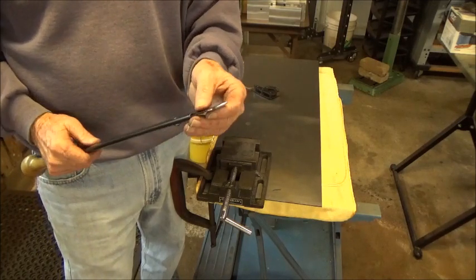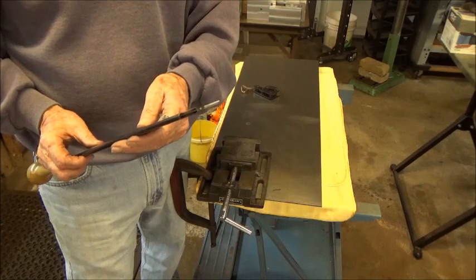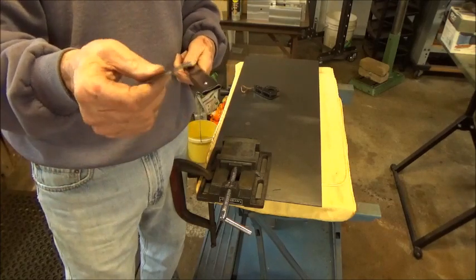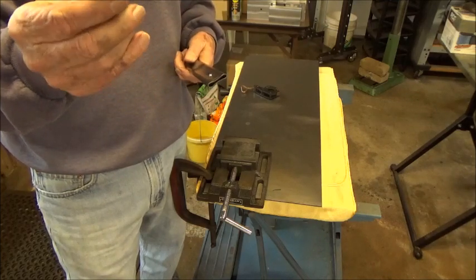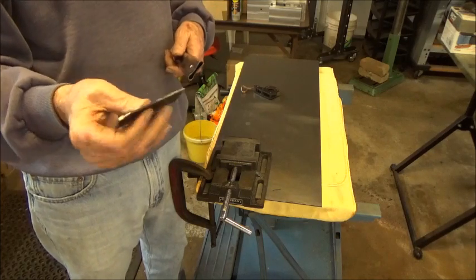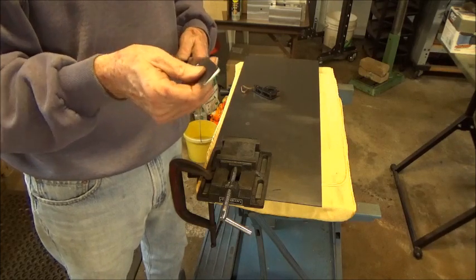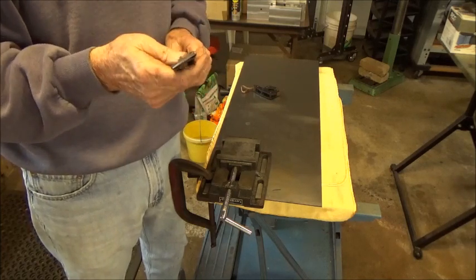It's not exactly centered but that doesn't really make any difference. It was a little smaller lengthwise than it needed to be — it could have been about an eighth of an inch longer piece of carbide. One nice thing is, it's tool steel that's been hardened that you can buy from Anderson, and these are fairly inexpensive. So actually this makes a good blank. I've tried to make my own before, but I need the carbide on the end of it — maybe it would work for scraping aluminum, but it doesn't work very well for scraping cast iron or steel. It does fit perfectly into their scraper though.